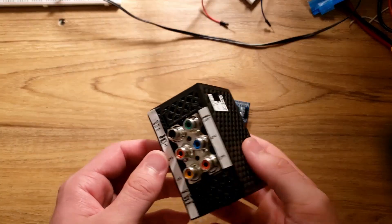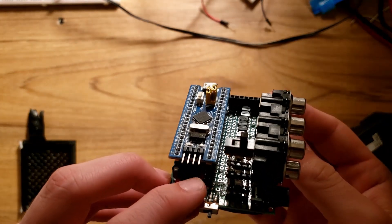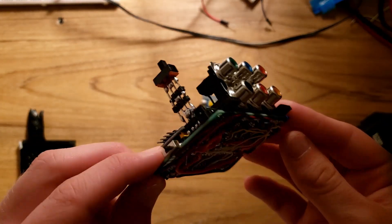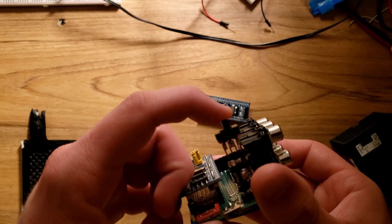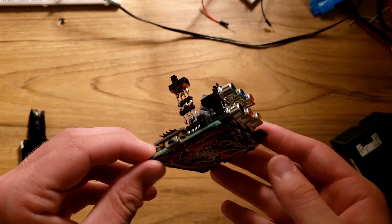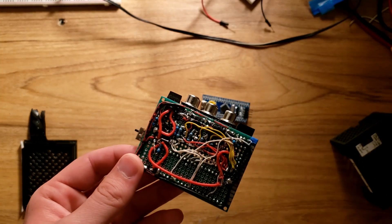Here's some of the hardware I have. On the top side where those transistors are, that's protection from overvoltage and undervoltage conditions. With this switch we have the opportunity to do unipolar and bipolar input sensing, and we do that without the need for a dual power supply. We'll jump right into how the clamping circuitry works.